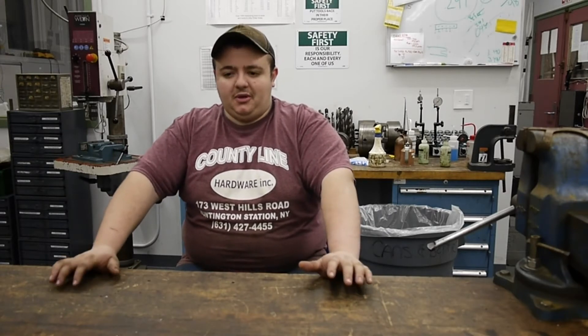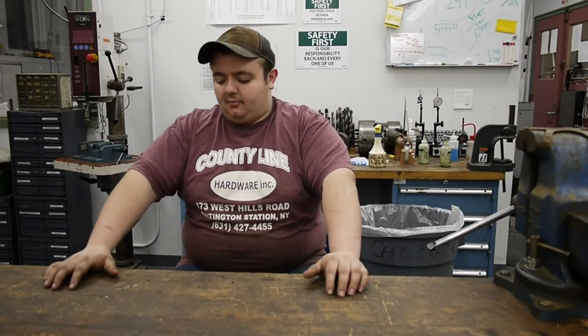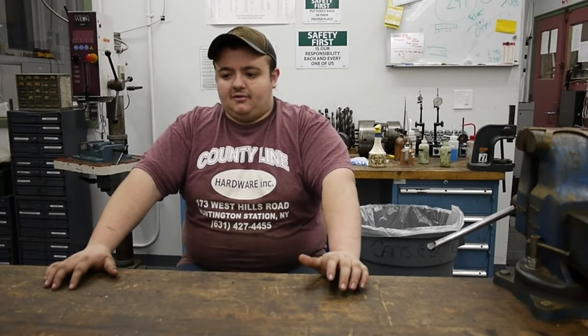As you'll see in the other video I posted, I've been looking for a bigger machine. You may think: why would I go towards buying a horizontal mill when a Bridgeport is probably the better machine for universal production? But I want a horizontal mill because they're just so much more rigid than a Bridgeport. It's nice to walk up to a machine and take cuts without worrying about rigidity, vibration, or chatter.